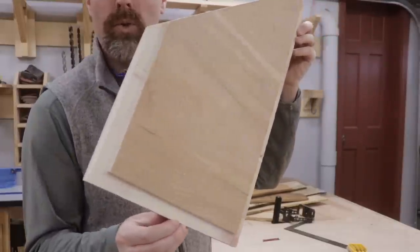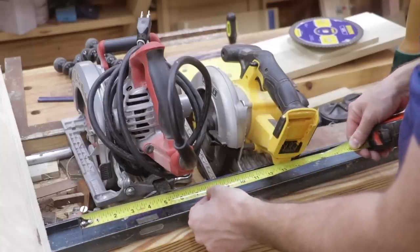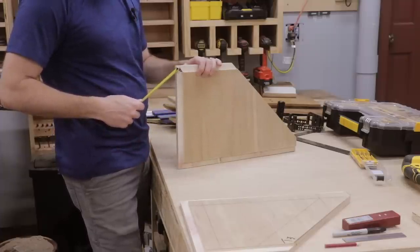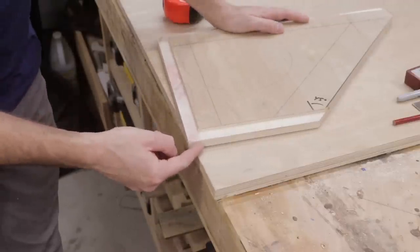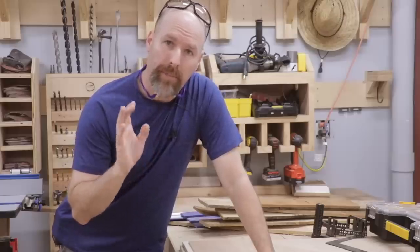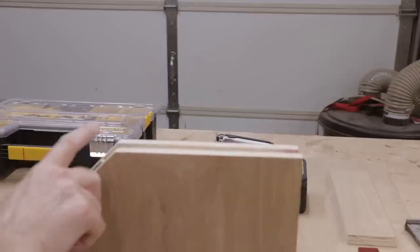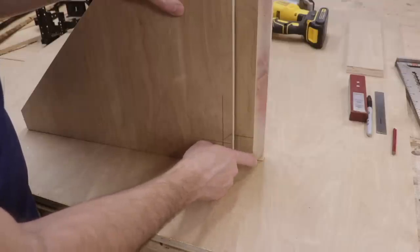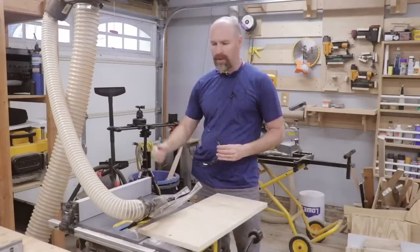That should make the joints a lot stronger around the outside of the cabinet. I measured side to side to see what the width of our cabinet should be, and 18 inches seems about right. To achieve 18 inches in width, I need to account for the rabbet joints on each sideboard — each sideboard has a quarter inch cut rabbet, leaving half an inch of board left. So the front and back pieces of the cabinet need to be 17 inches in length. The front piece needs to account for a 45-degree miter angle, while the back piece just needs a rabbet joint to help house the bottom of the cabinet.